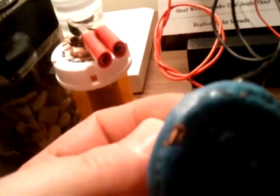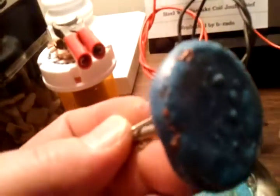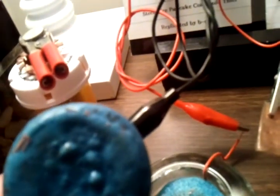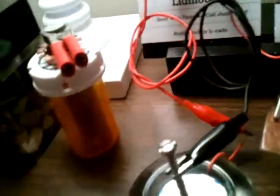So far this thing's been running three days now and I see no black oxide forming. But what I do see — if you can see right there — that's copper. As that copper sulfate is attacking the hydrogen going to the copper electrode, it shoots a little piece of copper metal out of the copper sulfate as it's attacking that hydrogen. So it is depositing some of that copper onto this electrode. But so far I do not see any of that black oxide, and this has been going three days. That's very encouraging.